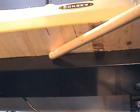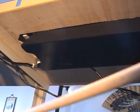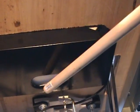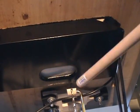This pan needs to be mounted as low as possible down underneath this table, because there's no clearance between the machine and the top of that pan. Keep it low and try to keep it level because it has a very small lip that keeps the drips from happening — it holds that much oil before the drips occur. I decided on mine, because it seems to want to drip oil right about here up in the machine when I oil it, to put a piece of plastic over that so it missed that hole.